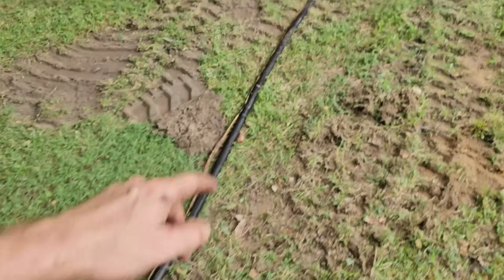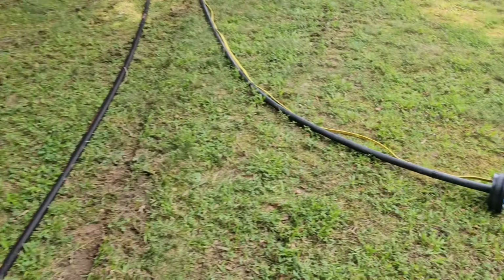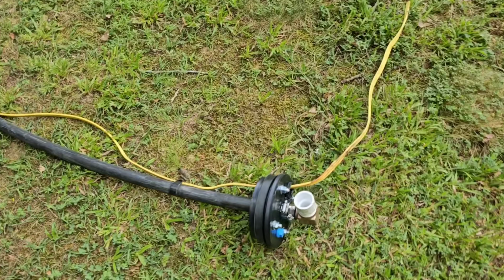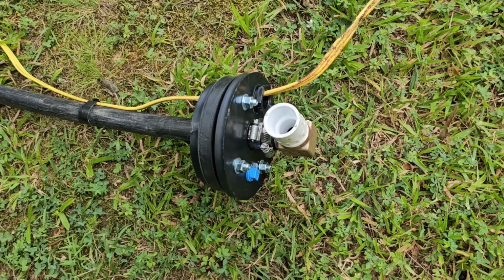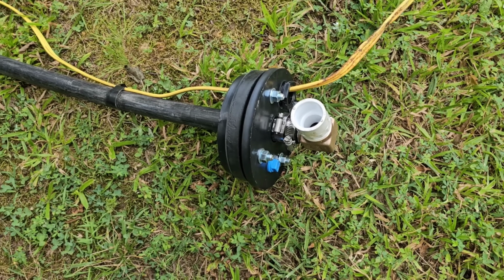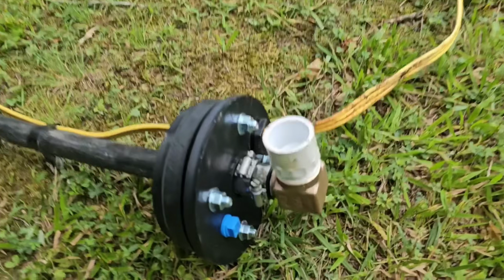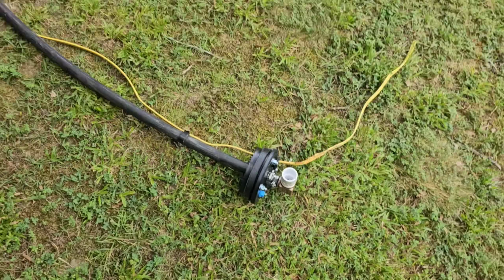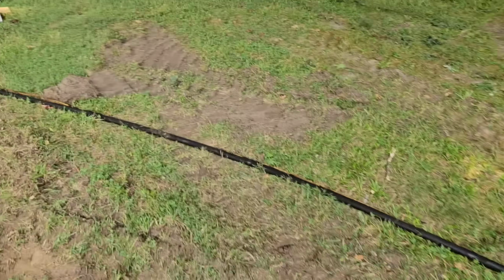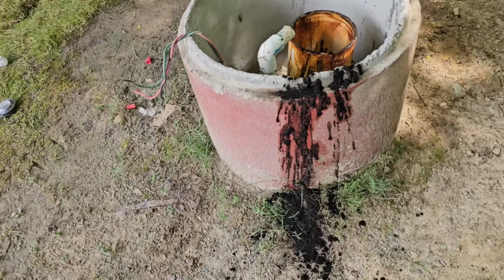I actually went all the way down the pipe trying to squeegee a lot of that manganese off of it. And then I got the new well seal here. There's no need for a metal well seal. It's only in there at this point like 215 foot. So we're just going to hang it on an ABS well seal and a brand new brass elbow, because the other one looked to be in pretty sad shape. But I'm going to go ahead now. We'll put the wheels on the well. God, look at that. That is just pitiful.